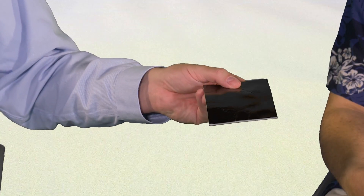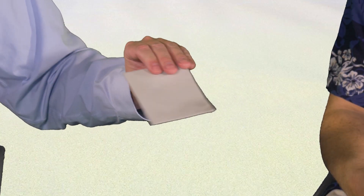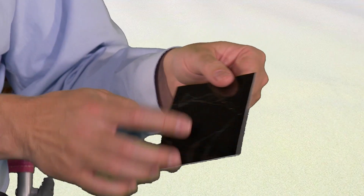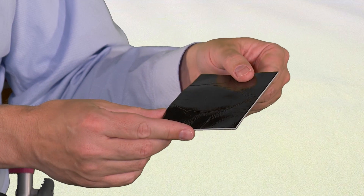Semi-sealing material is a softer version of PGS. It has the advantage to cover uneven heights on a circuit board. It's a thermoplastic resin with a strip of PGS adhered to it, so it can conform to components at different heights and reduce thermal resistance.